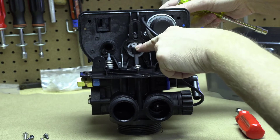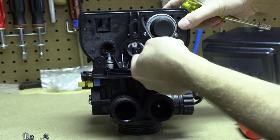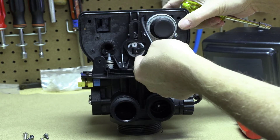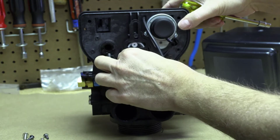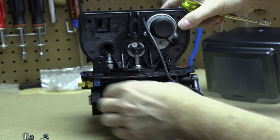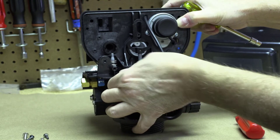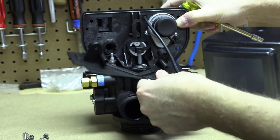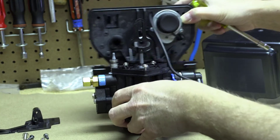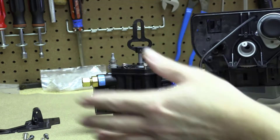When you pull the control head away, you can see where the white gear post is poking through where the piston is. When you put it back, you'll have to manually adjust the piston with your fingers to get it to line up with that spot. Wiggle it and the back plate will come free, then the front portion of the valve will fall away — just leave it connected to the cable.